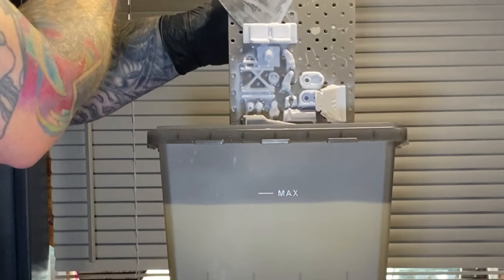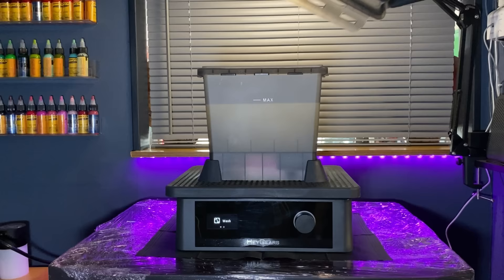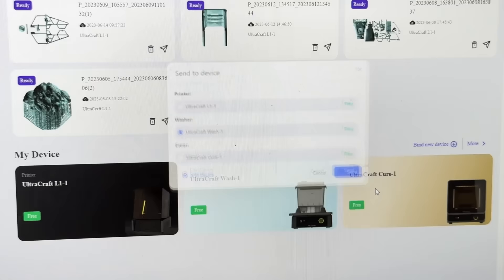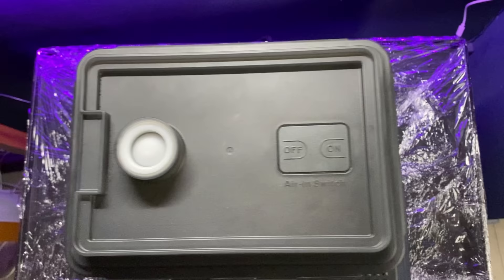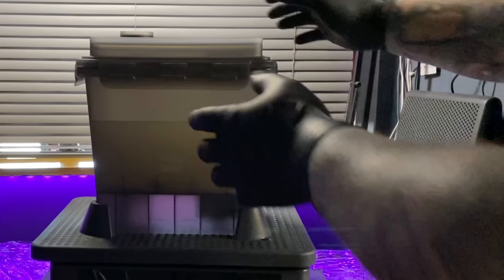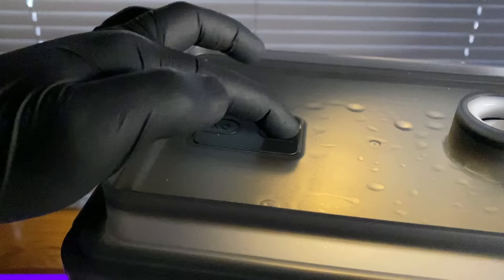There is also the independent washing box design, which means you do not need to touch resin at all during the printing process. I didn't use very many supports on my model because this one was printed flat on the build plate, which is a big test many people overlook. Printing flat on the build plate is difficult — you need to expose it just enough to keep the parts on the plate, otherwise you can end up with a large elephant foot at the bottom. I'm happy to say this print came off with almost no elephant foot, and it just peeled off the build plate easier than anything I've ever felt. I like everything about this build plate.